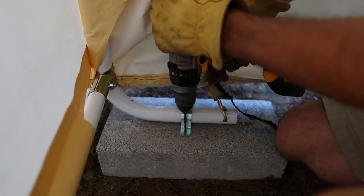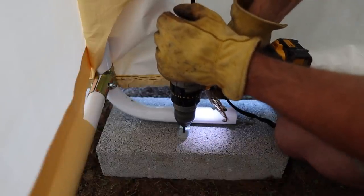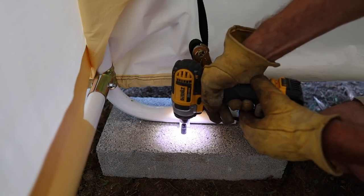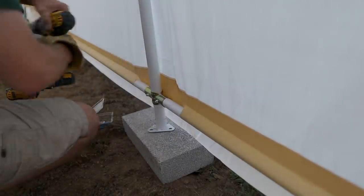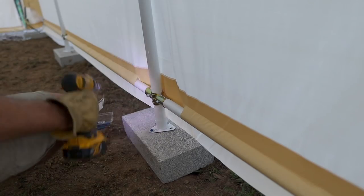For the corners, I have these two-hole inch-and-a-quarter straps. I'll place those on there, drill some holes, run some Tapcon screws in there, and that should hold it very nicely. I am losing daylight and losing energy, but I'm going to go around and finish screwing in all those blocks. The next step is going to be to bring in some wood chips and just line that floor with wood chips so it's not just dirt.